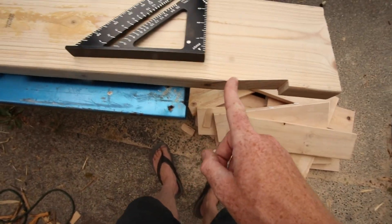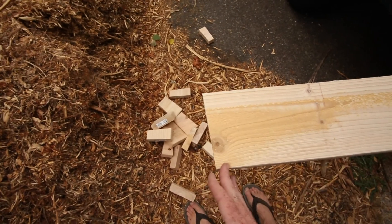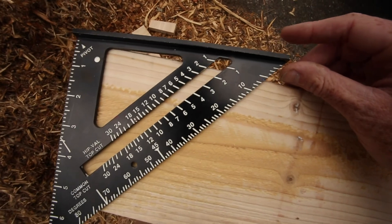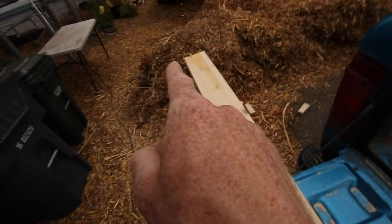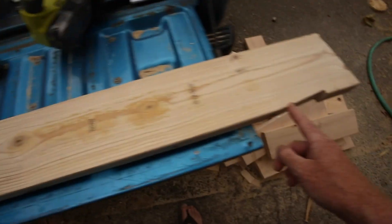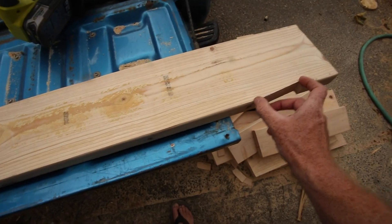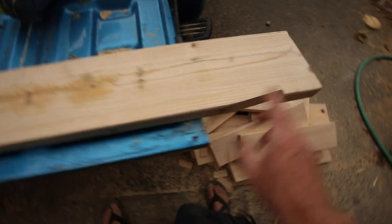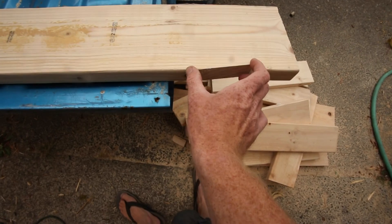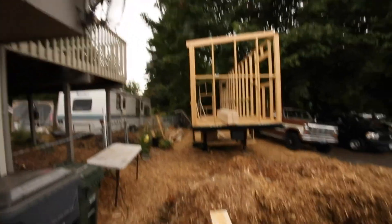Now your distance from here to over here — which is another plumb cut that we used our slope to figure out — it's lined up with the six degrees, or it's like 1.8, almost two. But you want to know your short to short, which is from the bottom of that top plumb cut to the top front part of your bottom plate, which is whatever the thickness of your top plate is — in this case a two by four. So it's about three and a half inches that this actually comes over from where it meets in the front. Then I just measured three and a half inches back, lined it up, and squared it out so that it sits flush up on there and forms a nice seat.